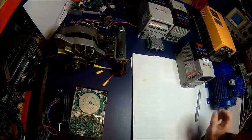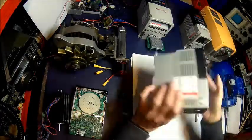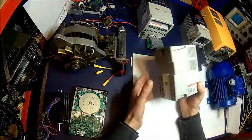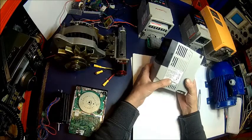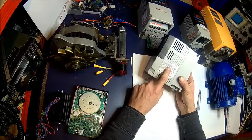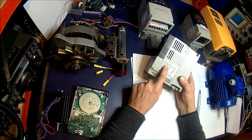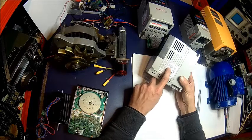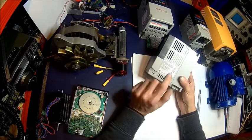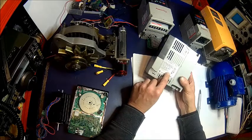There are different types of inverters. This 400-volt inverter here — I've got some Allen Bradleys — any inverter drive will pretty much give you the same result. This other one is a 200–240-volt type, 48 to 63 Hz, with an AC input range of 180 to 264 volts and output of 0 to 230 volts. So how can you run a three-phase motor on 230 volts? The nameplate says 230/380 and there's a reason for that.